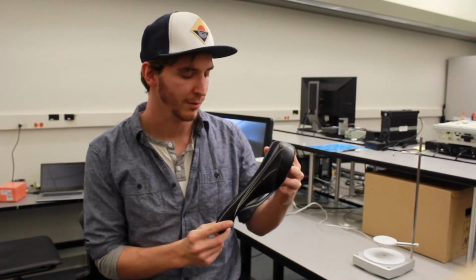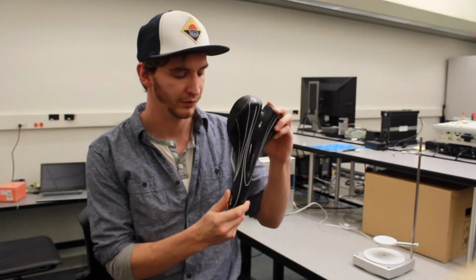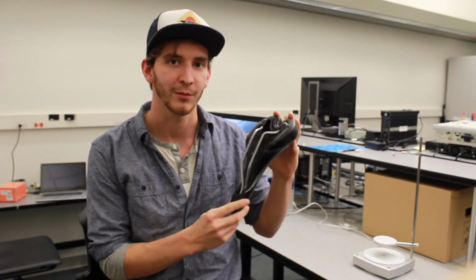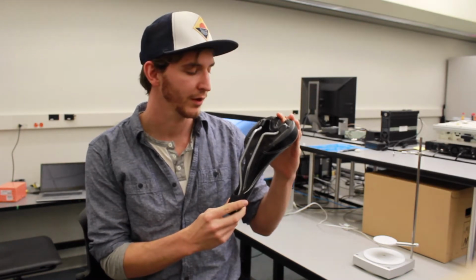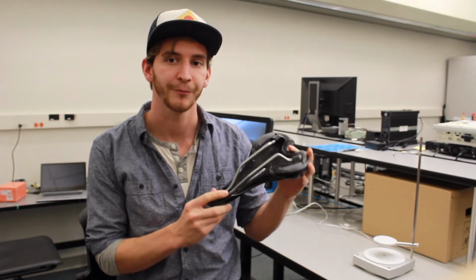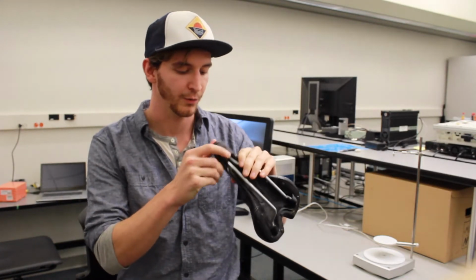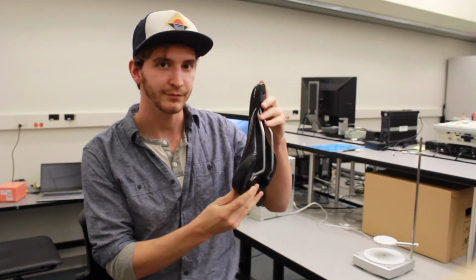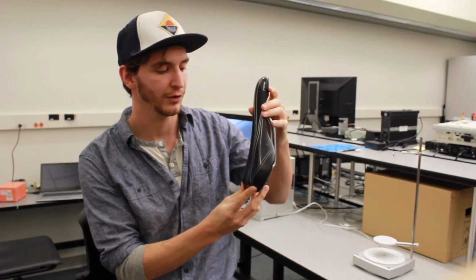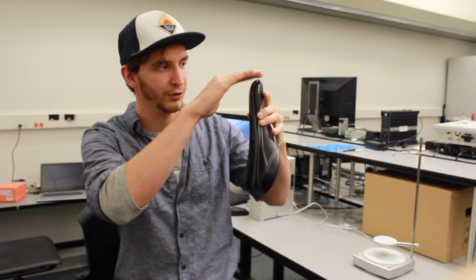We thought this was a good option just because of the different holes and geometry that you've got going on here with the rails. So it'll add some complexity to your model, which could give you difficulties depending on your settings. And we'll show you some techniques how to handle that. Also, it's an important thing to note, when you've got your 3D scanner, everything not perpendicular to the scanner is going to have a really hard time being picked up. So that's talking about the top of your seat, the bottom.